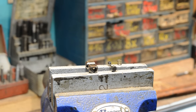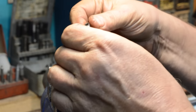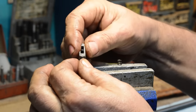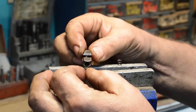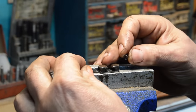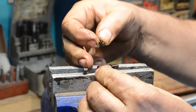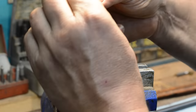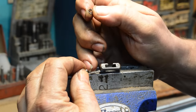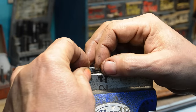So having redone that part, there's something I want to show you — and I think I know why it was bent. There's a big end of this thing and a little end to it, and this is supposed to slide through big end to little end. It'll do that until you put this spring in it. If you just insert the spring into the body, this thing will jam up and you have to bend it to try to get it together. What I'm here to tell you is there's a little step in this thing — this spring has to be put in and set down under that step. Bruno was able to easily swoop down and pick this part up — because we swept the damn floor. That spring has to be trapped under that step or else this will not slide together and it'll bind.